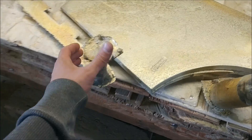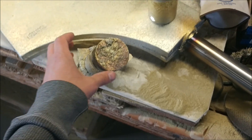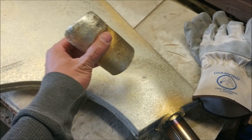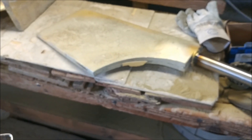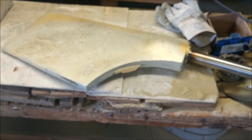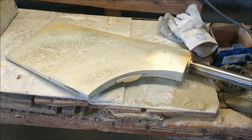I took the rudder and cut all the gates and risers off with the band saw. It's actually upside down, but there's a riser on the other side — I cut that all off. Now we have our rudder part and I'm going to clean it up a little bit with a hand sander and a grinder. We'll put a nice polish on it — take a look when it's done.